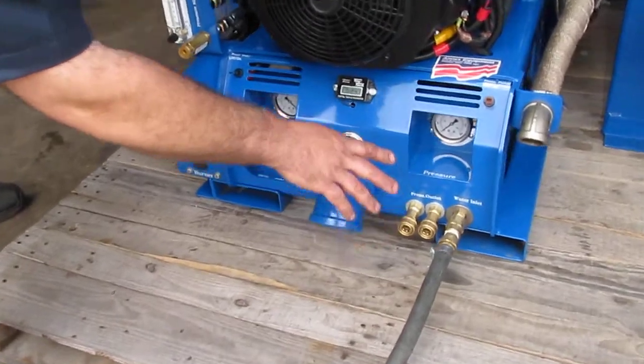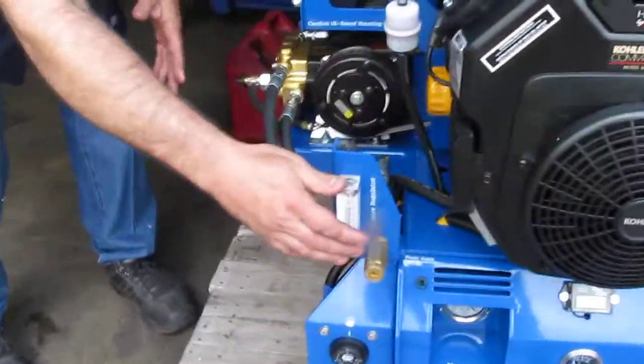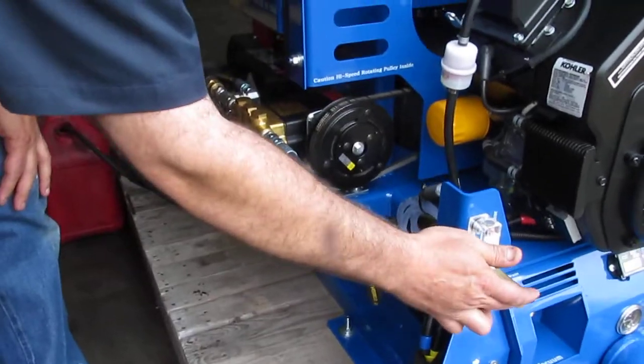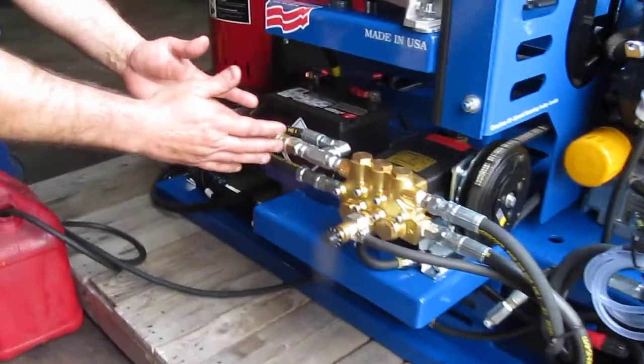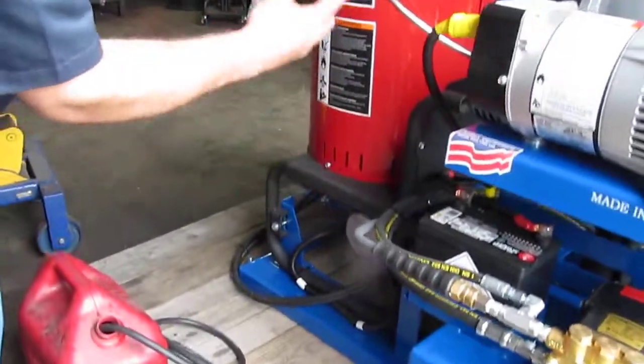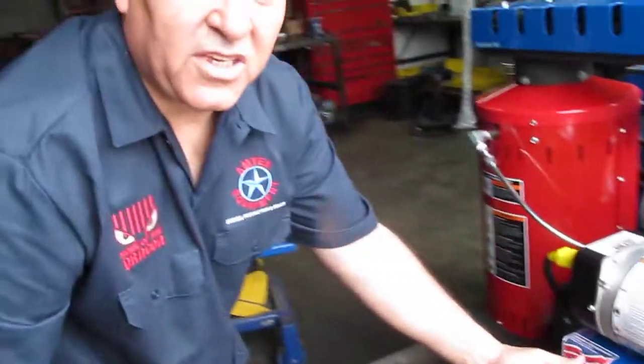You're allowing a small amount of water to leave the unit all the time from the yellow handle dripper valve. This allows the garden hose water to slowly go into the machine even if you're not using it — through the pump, which is a circuit between your regulator and your pump — and always allows water to go away from the pump through the heater, preventing any kind of problem with the seals. By following that dripper valve and having it slowly draining the tank, this machine can simply run until it runs out of gas.